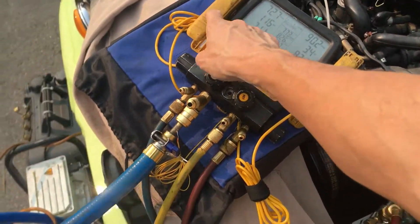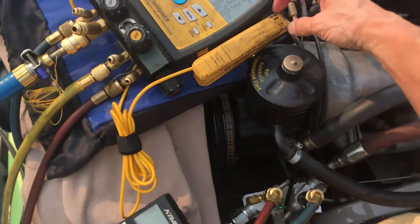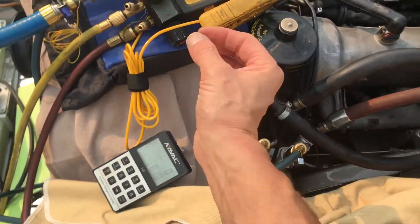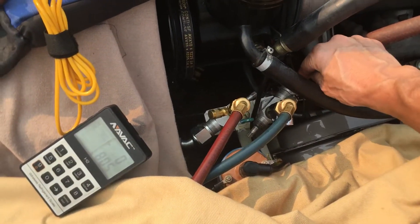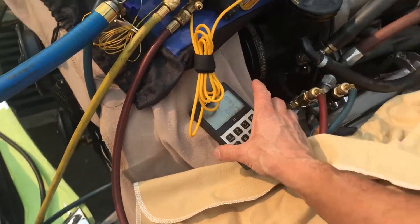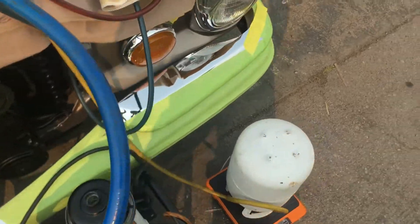As you notice, I do not have my temperature probes for superheat or subcooling, because they do not give me any metal anywhere I could grab on with these big wide clamps to get a good clamp for temperature. I'd have to use my wireless little bird-beak temperature sensors, or you could literally tape them on with some heat compound and foam insulation over them if you wanted to get really critical. But on this old system, this is a bulletproof dinosaur with R12 and a fixed piston compressor.